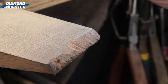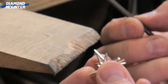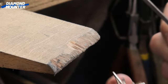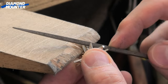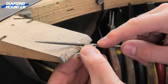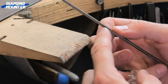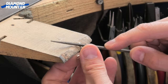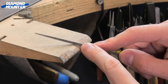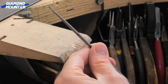It's a delicate little thing but its coarseness is really helpful — it can really shift metal quickly and easily. If I pick up one of these normal ones, the handle is here, and if I want to expose the whole blade I've got to sort of crunch my hand up more than is comfortable. More often than not your finger ends up on the blade, which can be uncomfortable. They're not a problem to use, but they can be uncomfortable. Some people put handles on them — you can get needle file handles — but I've never really felt the need.